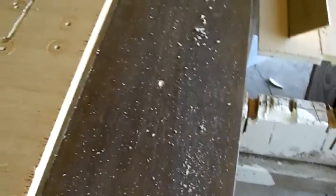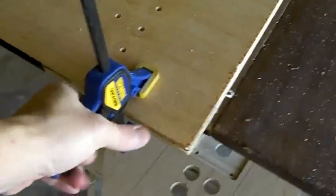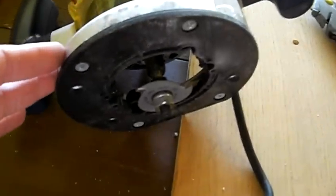It would help to clamp this wood down a little bit. When you're putting the T-molding in, I found a wooden mallet works real well. Just clamp down the top of the panel you're working on. Once you have your grooves routed with a 1/16th slot bit, you can take your T-molding, cut little V-grooves in your corners, and then as you go around, you just tap it in like that.